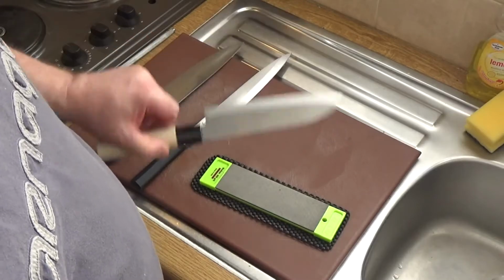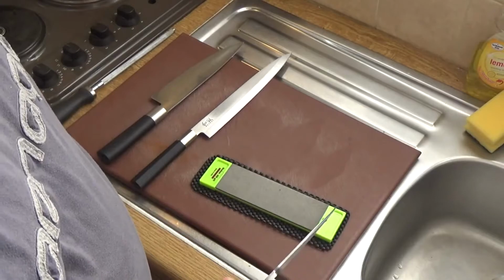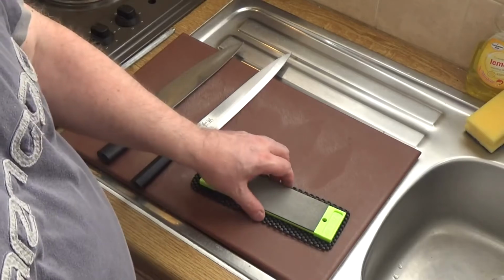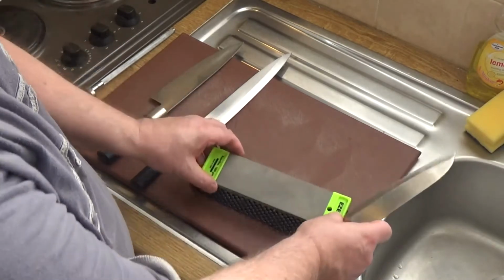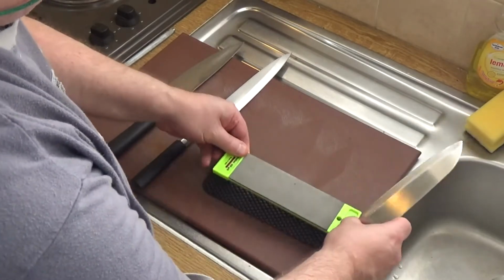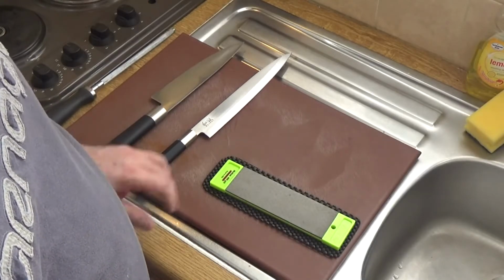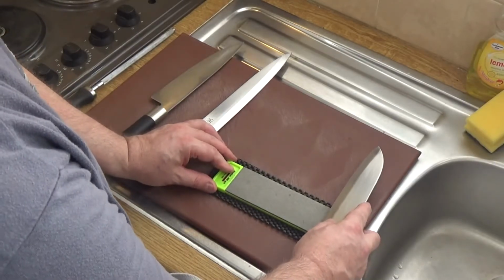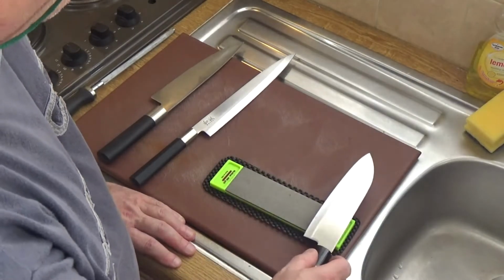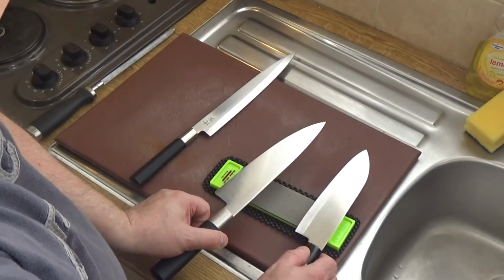The first part of the grind, of course, is to take off the round edges and turn it into a sharp knife, and then the second or fine grit is used to hone it super sharp. For normal kitchen use, you can probably get away with just using a 400 grit. If you want it super sharp, have a 1200 grit as well. So the way to do this, and this is with a hollow ground blade and flat ground blades, the method of sharpening is pretty much the same.